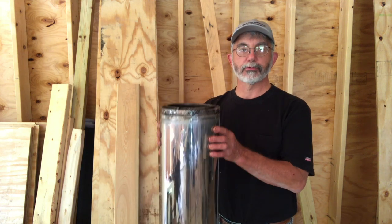Hi, I'm Herrick Kimball, and today in this video I'm going to show you how to cut an elliptical hole so a round pipe can go through a pitched roof. In this instance, it's a chimney pipe, eight inches outside diameter. I need a two inch airspace all the way around it, so I actually need a 12 inch diameter hole through my roof for this pipe.